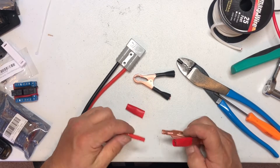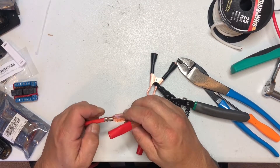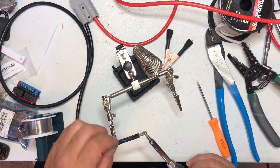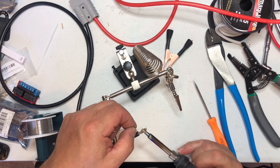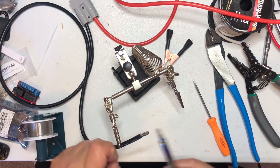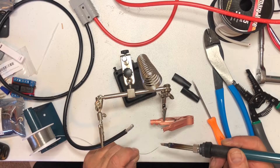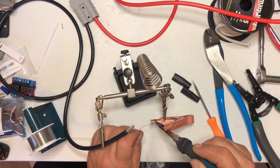On the other side I'm going to solder on some battery clamps. I always forget to put the sleeve on — if you're doing something like that, make sure you put the sleeve on before you solder it together. Here I'm just tinning the wire. I didn't leave in the whole process, I cut it short. I'm just using this pencil soldering iron — I have a bigger one but I forgot that at work also — but it still worked pretty good.